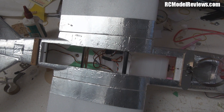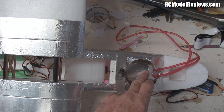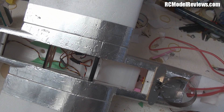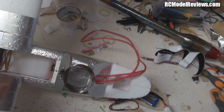We've made some significant changes to the model. We've moved the tank right back here — previously it was under this area, close to the motor spray bar. We've moved it right back so it's not too far in front of the CG, which means we'll have less trim change during flight. Tank size is the same, but I may increase it later if this all works out.